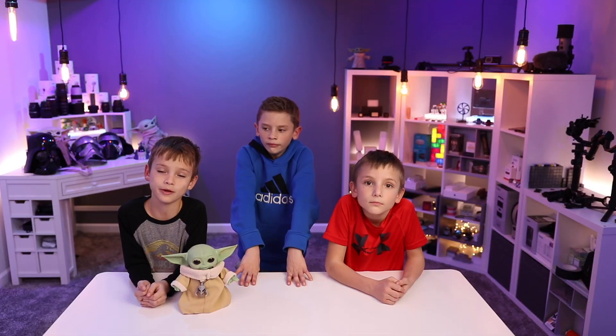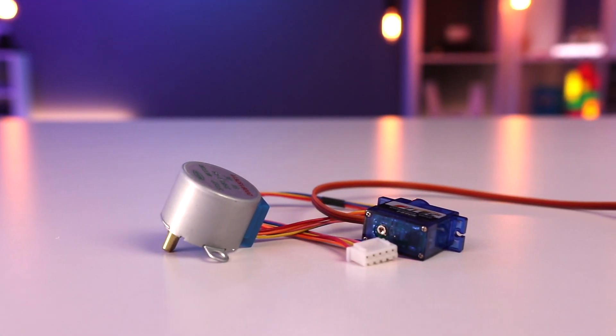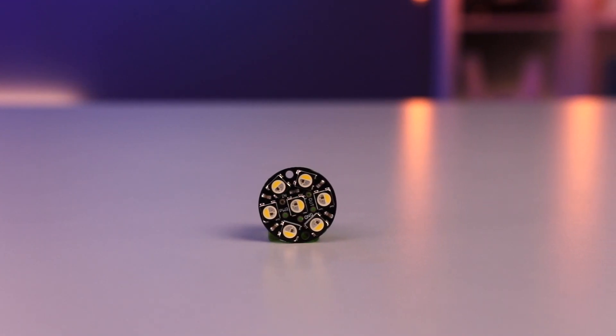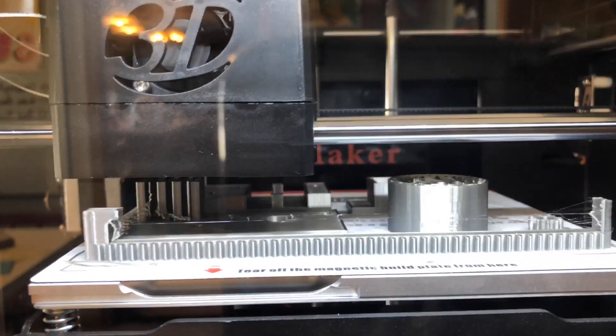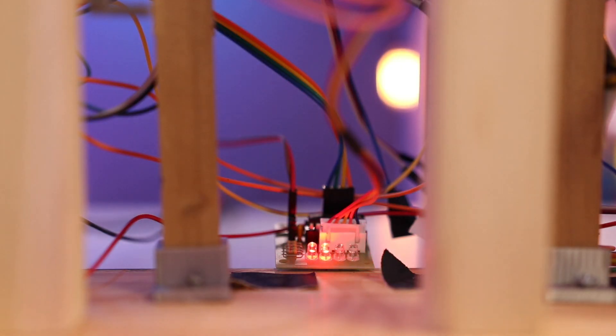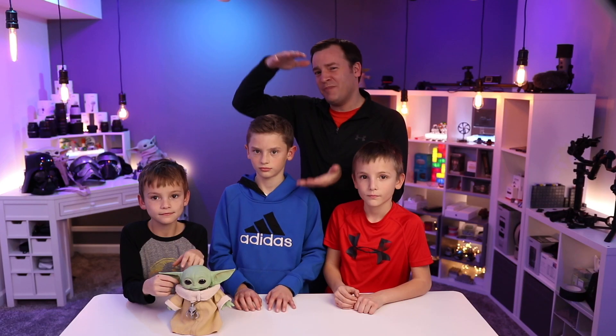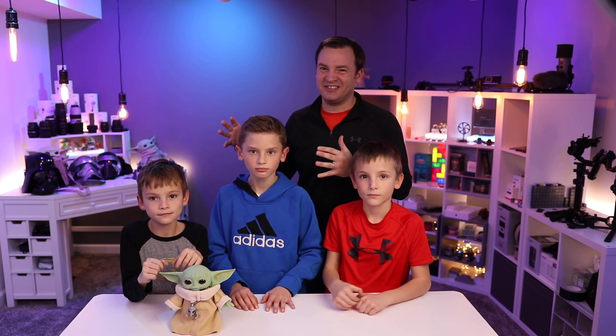We needed to pick a motor, so we tested a continuous servo but went with a stepper motor. Then we selected some NeoPixels for the lights. A few iterations later, we created something with the 3D printer to raise and lower the saber. After it was too late, we realized we could use a belt system to make the base more compact — but let's not let the dark side creep in.